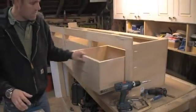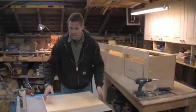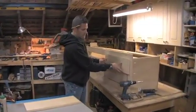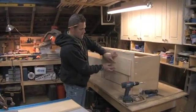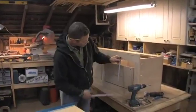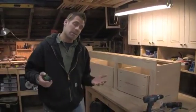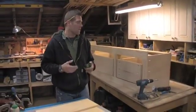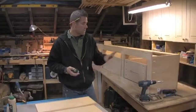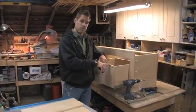All right, so now we've got our drawer. We can't leave it like that. We have to cover that opening, basically make it look nice. So to do this, we could use a really thick piece of wood. Now, most wood does not come 14 inches wide. And if you do, I'd be a little concerned that that wood would warp and cause all sorts of problems down the line. You could use plywood and veneer the edges like you did here in the drawer box,